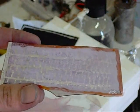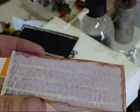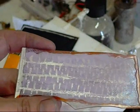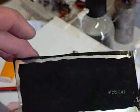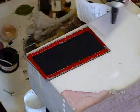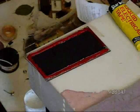I've got a tin oxide surface on the glass, the silver conducting paint into the matrix, and titanium dioxide with the dye embedded in it. And the same again, but this one has carbon instead of dye. I've run a ring of liquid electrical tape all around the side there, left a little gap at the top to let any of the electrolyte leak out.